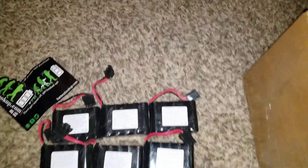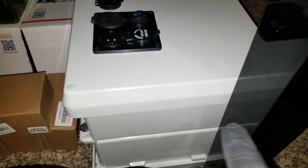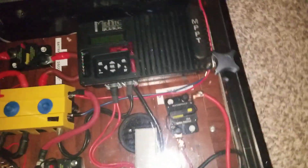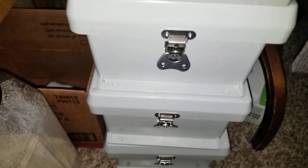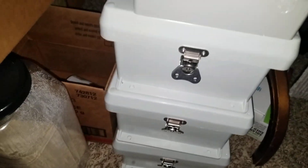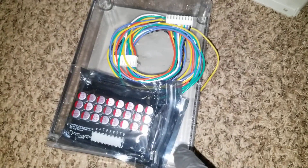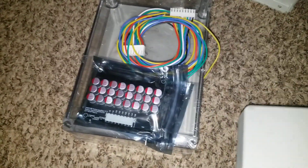With the boxes I have right here — lithium-ion and lithium polymer batteries — they work with these guys together. We have 16.2 volts with this pack system. These are the boxes I was talking about. I'm going to see how many of them can fit inside this box. I don't have to use external balancers because those batteries already have a BMS inside them.